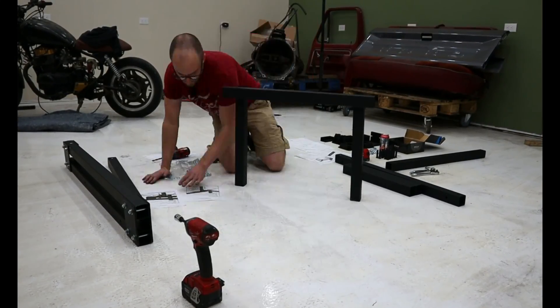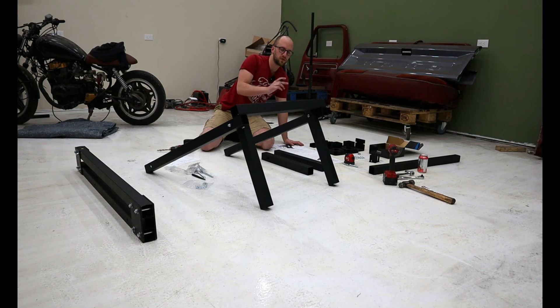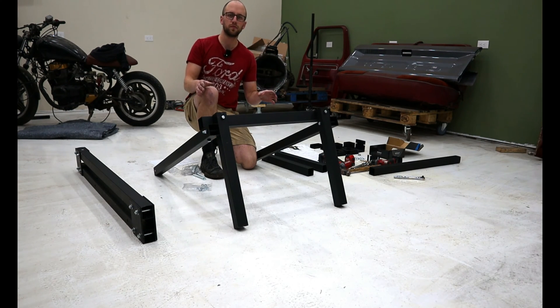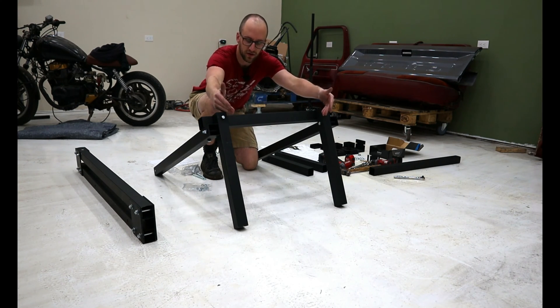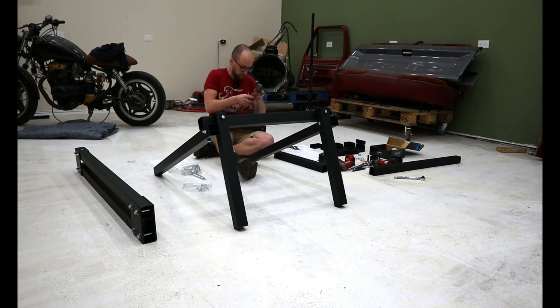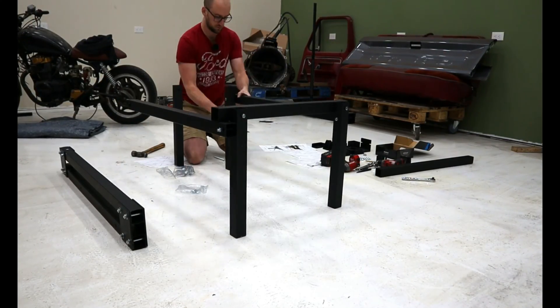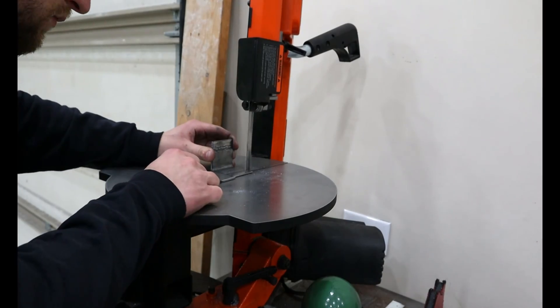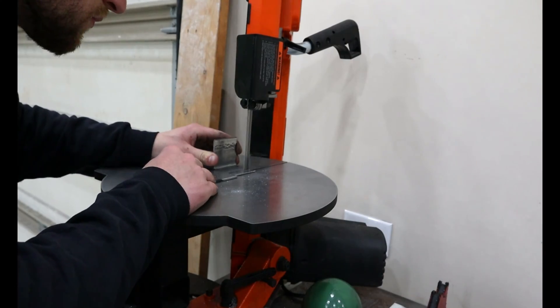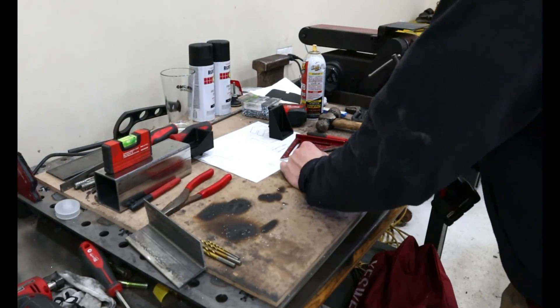I found the project more difficult than I initially expected. This was due to the instructions, but I don't want to fault JD's Garage — I printed them out and may have gotten them slightly out of order. We just got the table completely torn back down and put back together because I ended up flipping this bar over onto the other side, which messes up the complete rest of the assembly. Now we're back on track and we can focus on getting the legs and the other axes bolted on. As you saw, I measured everything out, center punched it, and slowly stepped up my drill bit sizes. However, when assembling, my holes did not line up perfectly and I ended up having to hog out the holes to get them to fit. I used a hand drill the entire project, which can walk if it isn't perpendicular to the material. A drill press would have been a better option, although I don't have one. Regardless, it was an easy fix.